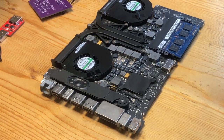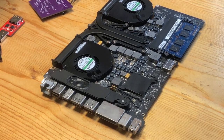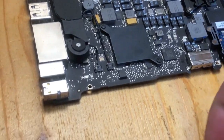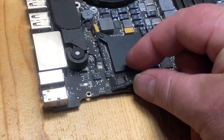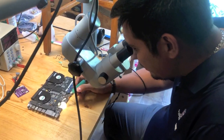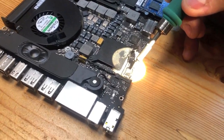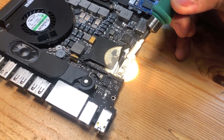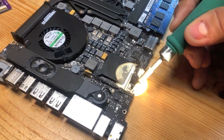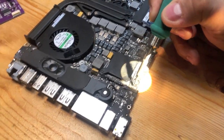Now the board is out of the computer and we will place the Terezias. The ROM chip where the Terezias mounts is here. The Terezias slots over the ROM very easily like this. The Terezias is mounted on the ROM, and you have to take care when soldering it not to pour too much solder down the legs of the ROM chip, because you'll make a short circuit between two adjacent pins — you try to avoid that.